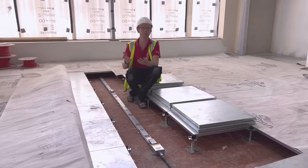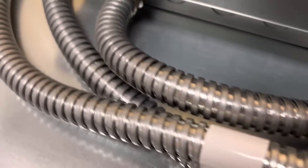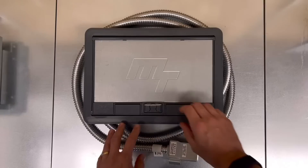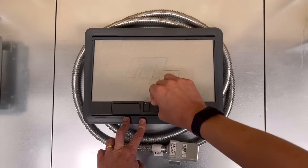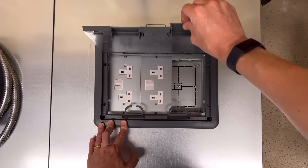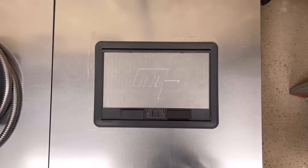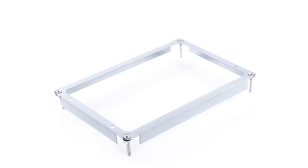To simplify and speed up installation, Marshall Tufflex also provide complete units where the tap-offs and boxes come pre-assembled to each other. Various combinations of three and four module boxes with one or two sockets are available in this pre-wired format. The lids of the boxes come in plastic for areas where they're not expected to get much of a battering, steel lids for areas of higher impact, and for the most intense areas there's a steel subframe assembly that reinforces the edges of the box, making it really tough.